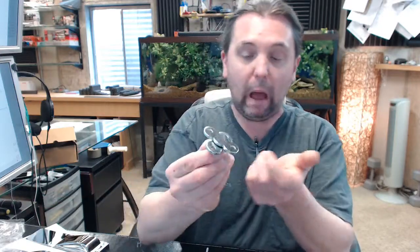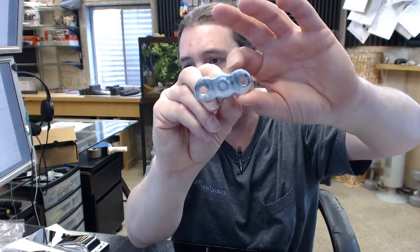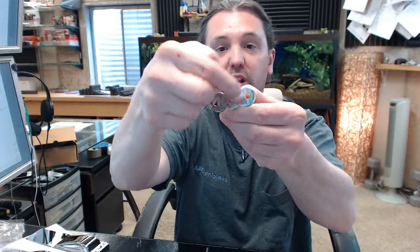Step 2 is prepping the top of the door and moving to all of step 2 for your pivot. Now when I've installed these, I like to think that laziness is the mother of innovation or invention. So installing the top portion, I would seek the easiest way to do it. This is I believe a 1-inch diameter. I would have a Forstner bit. I would find my center line of these 3 1-inch holes, and I would just make my preparation like that and be done with it.